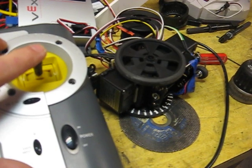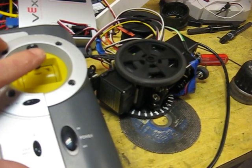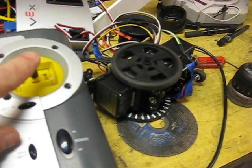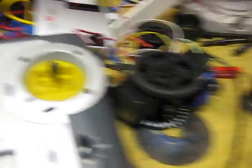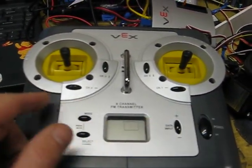I reckon with a variable of between 0 and 255 in a word value, you could use these commands coming from here, going into the pulse-in command of the PICAXE for just about anything. In this case, this is a six-channel remote.